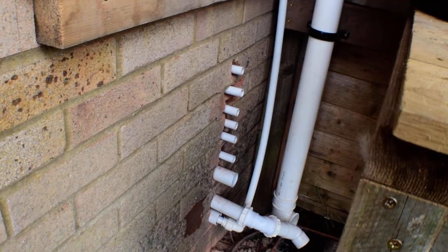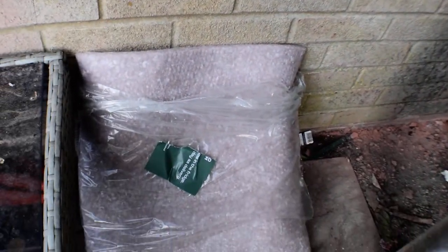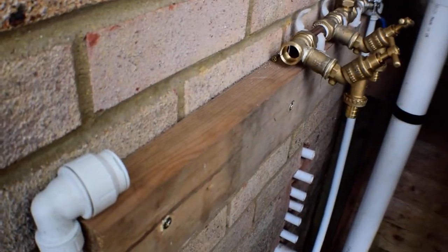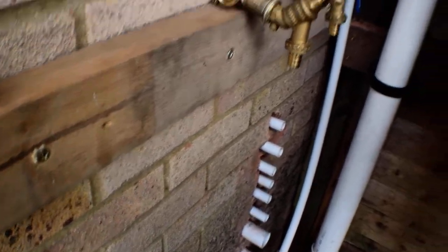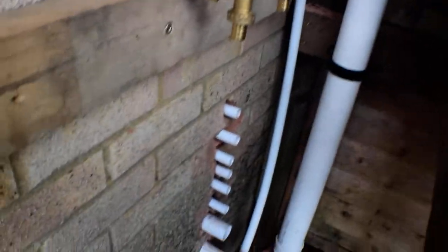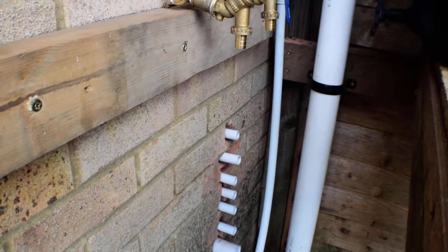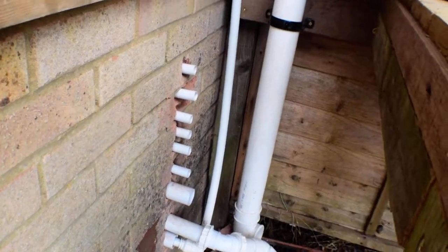You can see I've left those pipes out of the wall a little bit. My plan is, once they're in and I've done whatever I'm doing with the electrics, to use this stuff I get from HelloFresh which insulates the freezer stuff — it's actually pretty good insulation. I've been keeping it ever since we've been getting HelloFresh for six months or whatever, so I've got a load of them in the garage. If I keep it in the plastic and strap it to that wall, double it up maybe, that should bring out the thickness of this wood. I can then put some plywood straight down on top of it all — so it insulates everything. What I'll do is mount any pumps or timers for the irrigation on top of the wood above all of that. That will make it easier to make a little warm box because there are electrics, so I'm going to want to keep it frost free. That means I can insulate it up down in this area here, even if I have to do something against the back fence.